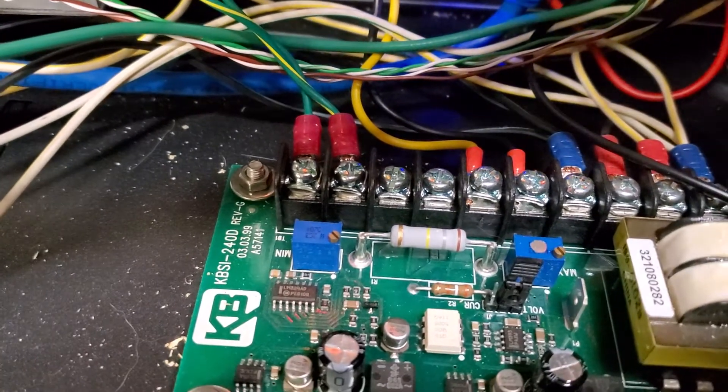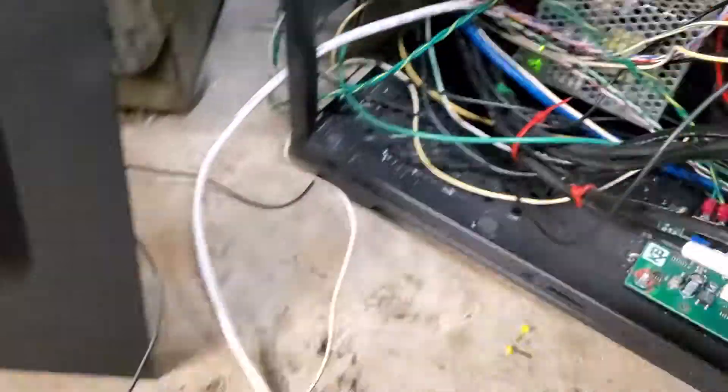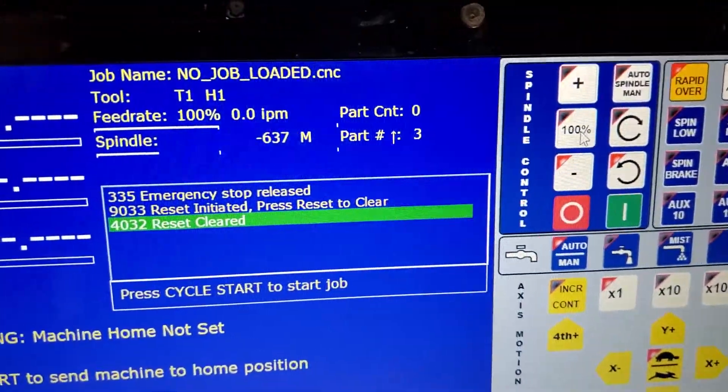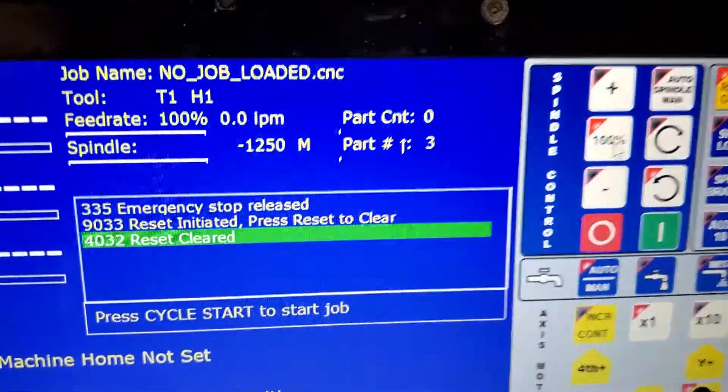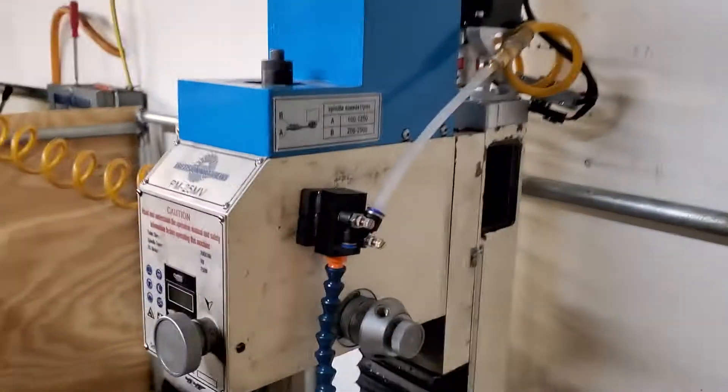My output is these two green wires right here. The mill needs to be five volts, so between these two little blue adjustment knobs right there you can adjust it so that when you're at 100% throttle it will be five volts. I just went up to five volts.